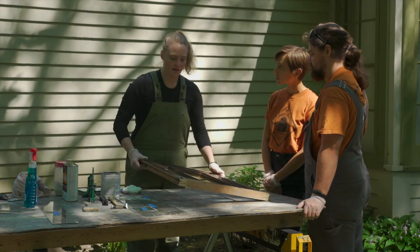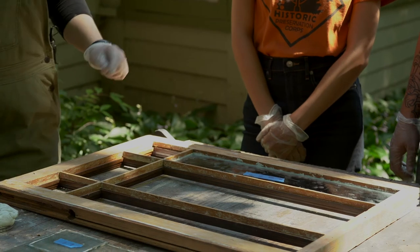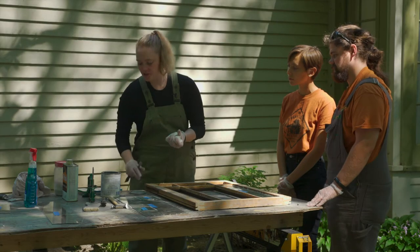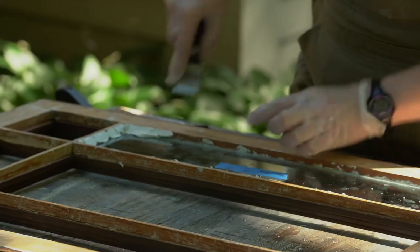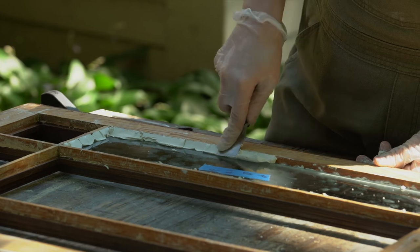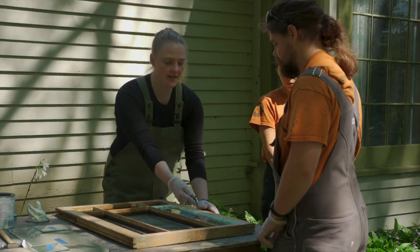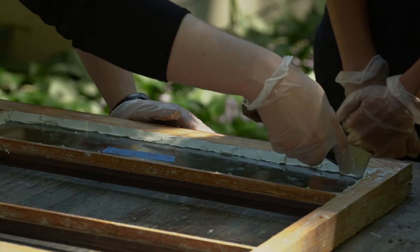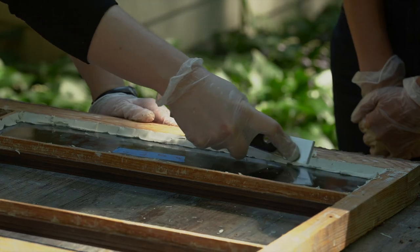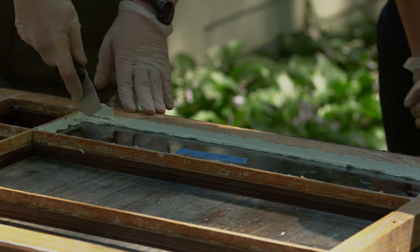That gives us a clear picture of where we need to glaze — we're going to fill these edges with glazing and then cut it back with either a glazing tool or an angled putty knife. Take a chunk of glazing putty, put a little on your glazing knife, and fill in the gap. To shape the putty, go in one long line with one pull, keeping your wrist in the same position. First cut into the corner at the angle you want, then tilt the knife down and let the wood edge guide it. Press down, drag toward you with your wrist locked in place, and tilt up into the corner.